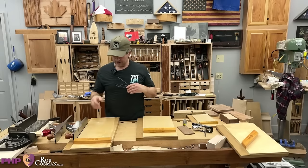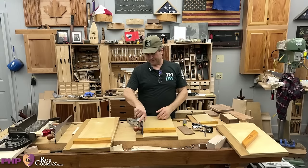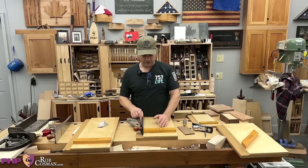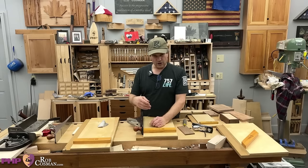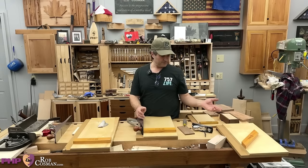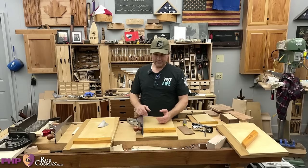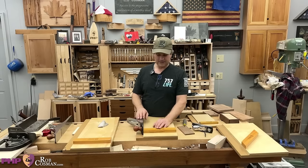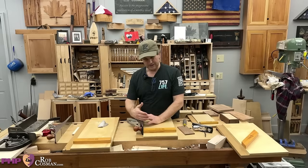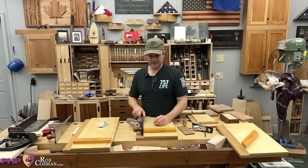The blade in a low angle plane sits, there's no frog, there's just a milled surface. That milled surface is 12 degrees. The blade's bevel is turned up. So if you're factoring the angle that you're actually meeting the wood, you've got to factor in all of those. The blade holding angle, 12, plus the bevel on the blade, which is another 25, which is 37. And almost all of us employ micro bevels so that we're not stuck polishing a great big wide surface. Micro bevels usually add up to 5 or 6, maybe even 7 degrees. So let's cut that in the middle and say 6. So you've got 37 plus 6 is 43. This blade is cutting at 45 degrees because the bevel is on the bottom side. The frog holds the blade at 45 degrees. That's all you have to factor in. So you're talking about a 2 degree difference. You think that's going to make a difference? No. Sharpness of the blade is far more important.